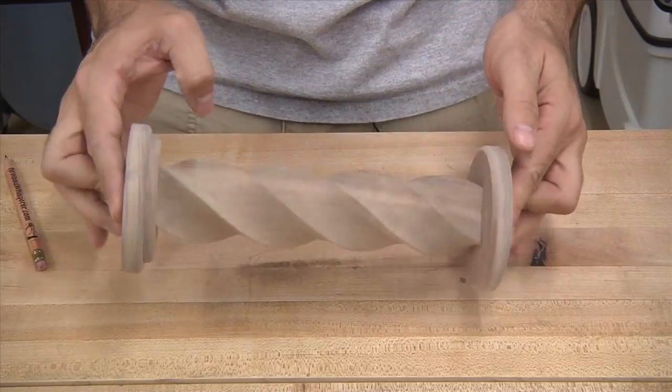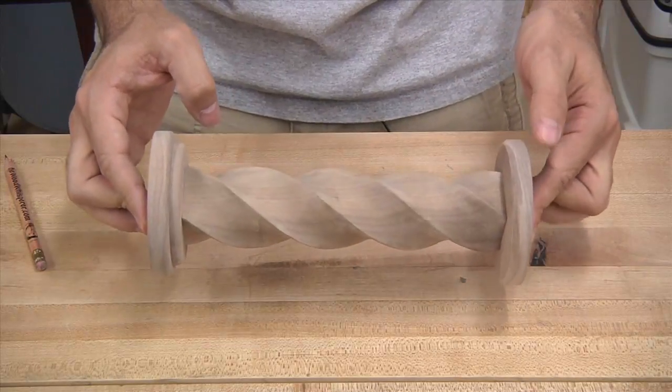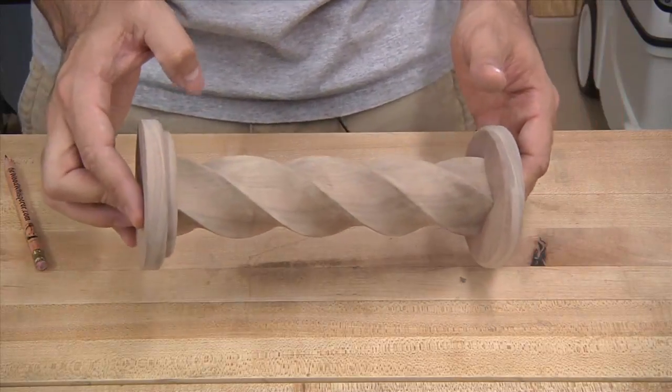And that looks good. So, you have a decision to make. Do you glue it together or do you pre-finish? Now for me, whenever possible, I do like to pre-finish because it just makes life so much easier. And if you have a situation where you can mask parts of the joinery, because obviously if you get finish on them, it doesn't accept glue as well.